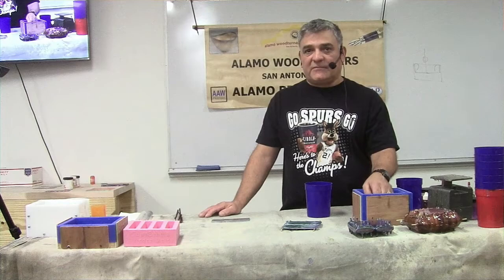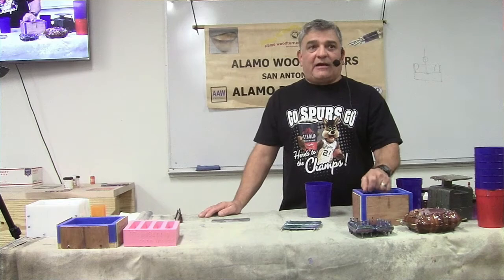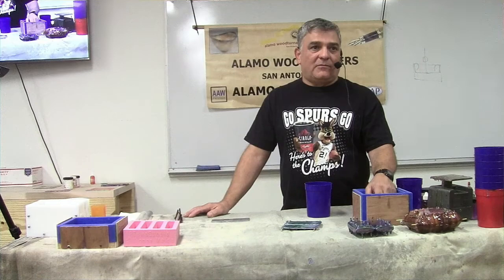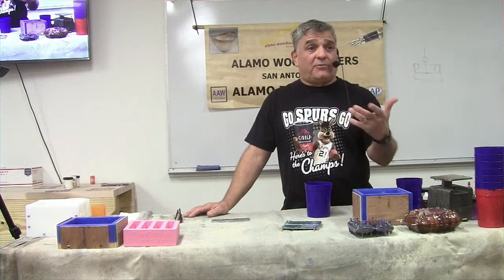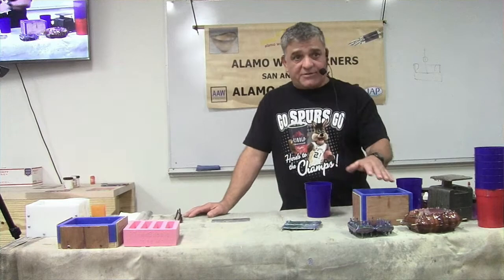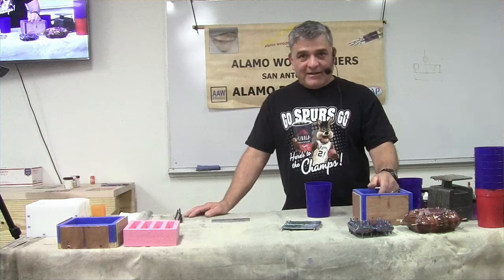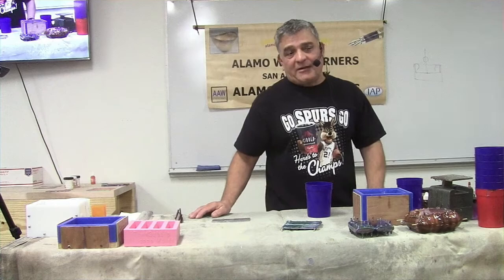I cast at a little higher pressure than the hobby 80 PSI. Not all woods absorb resin at the same rate - some it just won't penetrate no matter how much pressure you use, and stabilizing is your only option. But woods like spalted hackberry and pecan - I can get close to 100% penetration just with Alumilite resin at the right pressure, more than 80 PSI. I'm soon to have a new shop and I'm looking forward to setting up a corner for stabilizing just for fun, but right now I don't have the space.